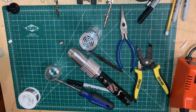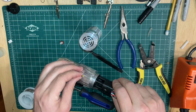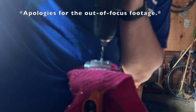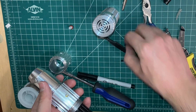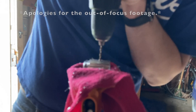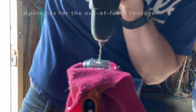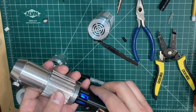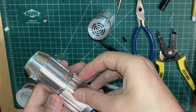I originally wanted tactile switches for the Shoto lightsaber — they saved space and I had designed some 3D printed buttons that I thought would look pretty cool. However, this took some precise drilling that I was unable to pull off for two reasons. The first was I just failed to do proper measurements ahead of time to line up the holes properly. Second, because I don't have a drill press and I use a hand drill, it was extremely difficult to drill in the precise spot needed so that the tactile switches on the chassis lined up with the holes. So most likely, if I want to do tactile switches, I'm going to have to retry this again later in the future.